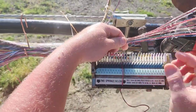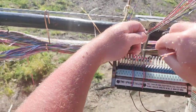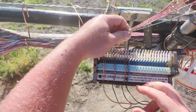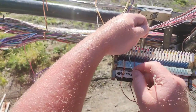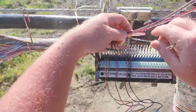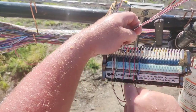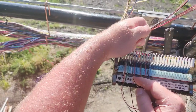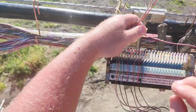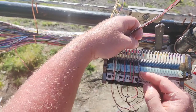Set that to the side and lay your cable in here. Some guys are really fast at this, some aren't — it really depends on the workload too. Take your pairs and lay them in. These pairs are all color-coded on the comb, so just go color for color: white-blue all the way to violet-slate. Pull them nice and tight — the tighter you pull them and stick them down in your springs, the better they'll stay when you go to crimp it. I already made a mistake: I put the red-brown in the red-slate spot.